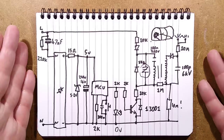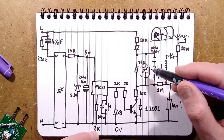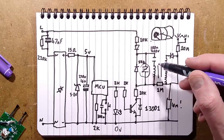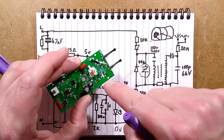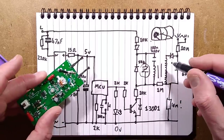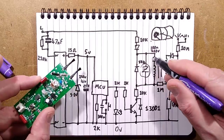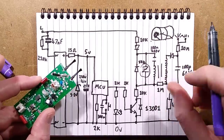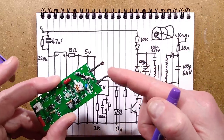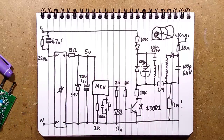The fact is 110 to 240 volt means that ultimately on 110 volt, it's going to be slightly less spicy, but it's quite a zesty unit on, surprising given the size of the transformer and the simplicity of the circuitry. But it's a zesty unit on 240 volts. So on 110 volts, all that will happen is that the capacitor will charge slightly slower, or pulse less often. You might end up with slightly less output in this. And that is it. A universal module.